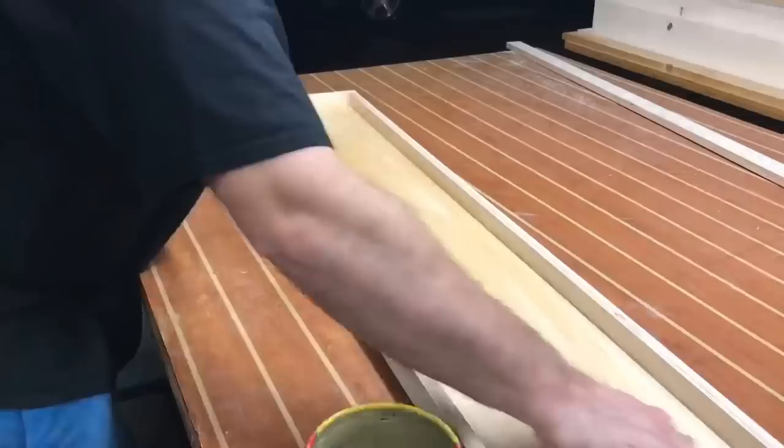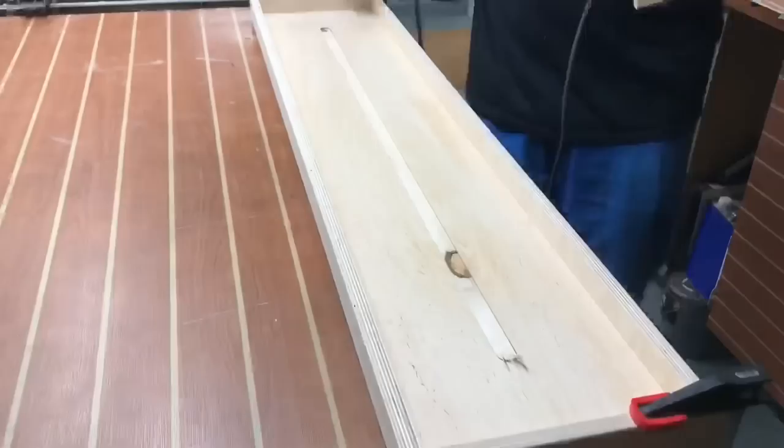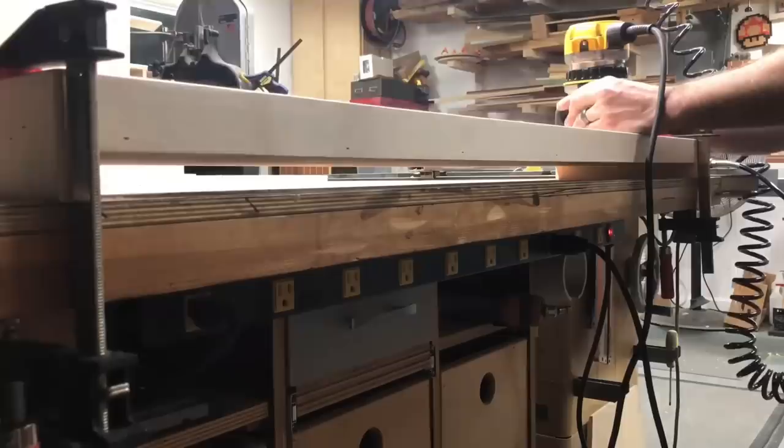Okay, now it's time to cut a channel into the tray that's going to allow us to cut through this to flatten out some slabs. I simply use a straight bit, 1/2 inch in diameter. I lower it bit by bit, pun intended, I suppose, until we break through, which we've done right here. And now, let's try it out on a slab.